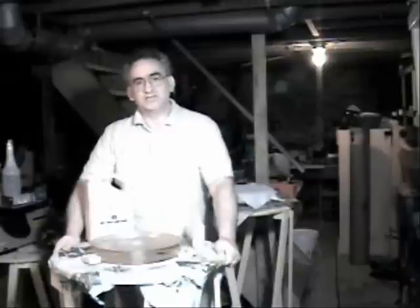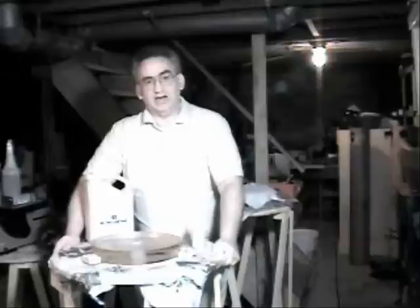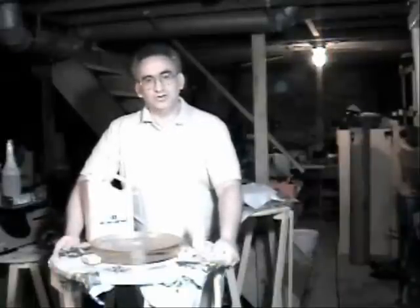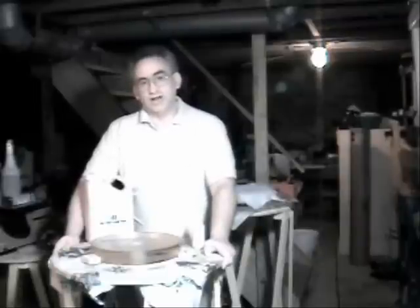I've already polished out one of my three flats and I was amazed to see that I was able to polish it out thoroughly and completely in four hours. Having checked it under a microscope, there is nothing left on that flat that can be polished out. It is perfectly polished — a deep thorough polish. Normally one would think that you would polish about two hours per inch of diameter, so I was expecting to spend in excess of 24 to 25 hours polishing that particular flat. I was absolutely amazed.